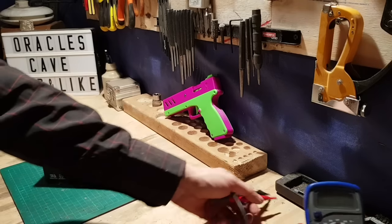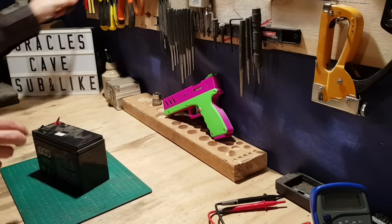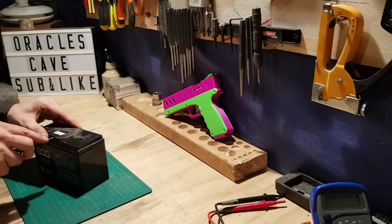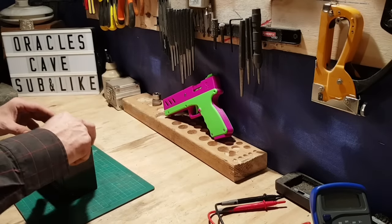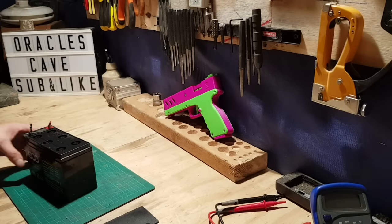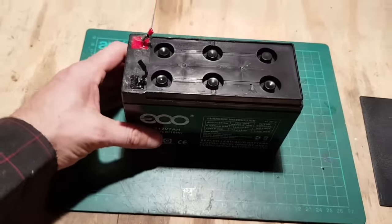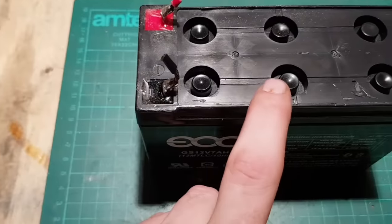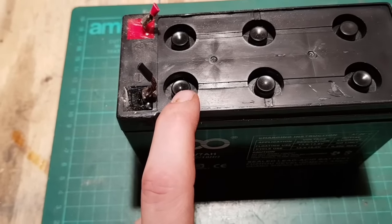So let's get this battery working again. First of all, I want to pop the cap. I'll have three batteries to fix in total, so it's probably going to take a couple of days. There's the cap off. This is a sealed lead acid battery — we'll bring the caps off, these are just little rubber caps. If you notice, see how they're sucked in? That tells me the cells are empty inside there.